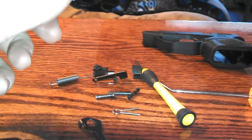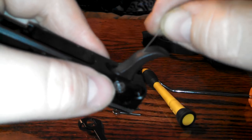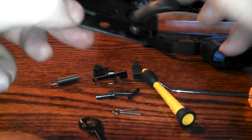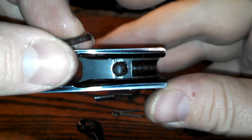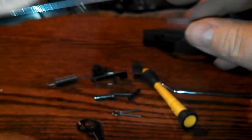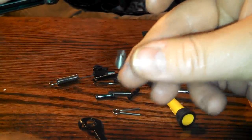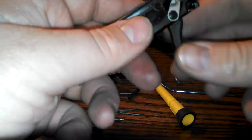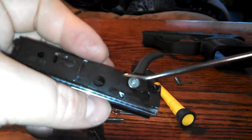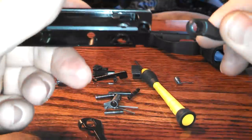Now you've got your trigger. If you want to get this all the way apart, there is a little hole at the base of this. I'm using a sewing needle — anything stiff and very thin will push on this pin. This pin actually goes in that hole in the trigger. That is what was holding the trigger bar spring, and it's also holding the trigger and the trigger pivot in place. The trigger pivot goes through the other side; the slide latch actually rides on it. Just push that out and it falls out — there's your trigger. You've completely disassembled.